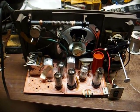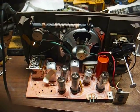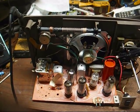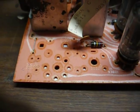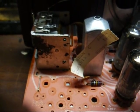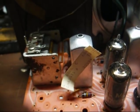We're apart. And this is what a brand new unused radio chassis looks like — not a speck of dust anywhere, no discolored parts, no tubes on their last leg. All that I can tell is wrong is this capacitor right here. The tubes are date coded 65, so this is probably from 65 or 66. And if you'll notice here, there's a space on the board for an extra tube socket and another transformer and some more components. That's because there was a version of this radio made that had a three-gang capacitor in a tuned RF stage. I was hoping this one would be that radio, but that's not the case.